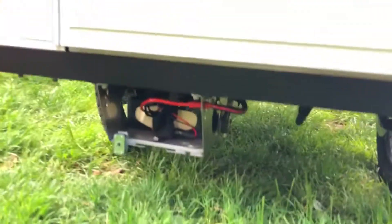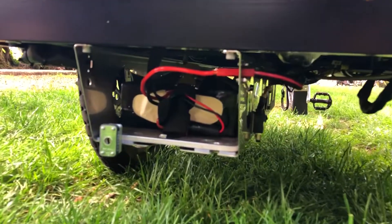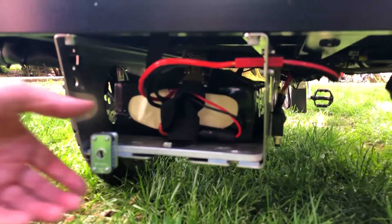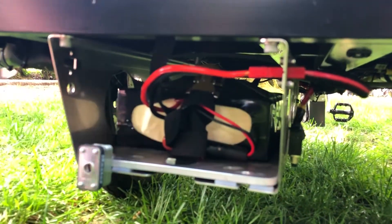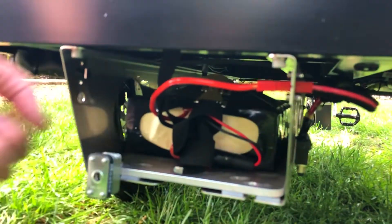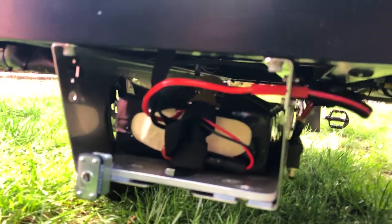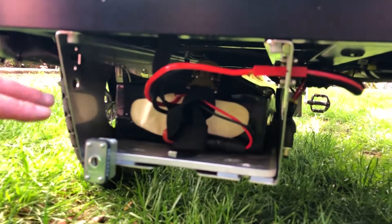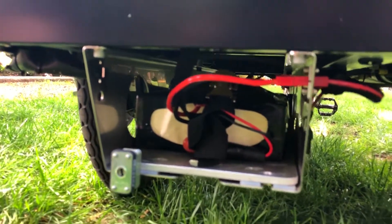That's our battery tray. This is actually an older system of ours, but it's a quick-swap system. We try to secure that because lithium batteries are crazy expensive. There's a tray with the battery on it, and typically you'll keep a battery at your home base charged up so you can do a quick swap and keep on going, because the batteries typically take six or eight hours to charge up.